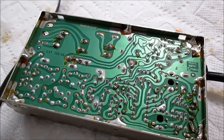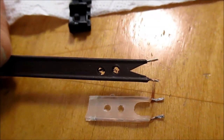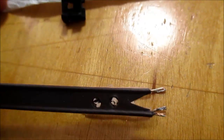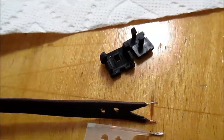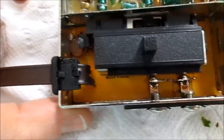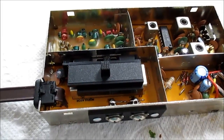Working on this RF modulator. I used the old broken-off twin lead — found some twin lead in my wire box upstairs, so I drilled some holes and used that as a template so I can get this strain relief on there and put it back in. Okay, that thing is soldered in and repaired. I'll just button this thing up and test it.